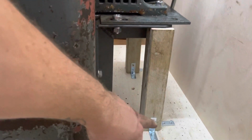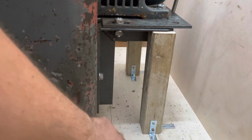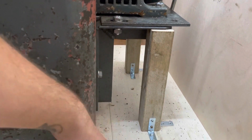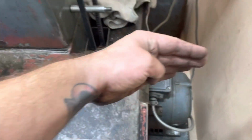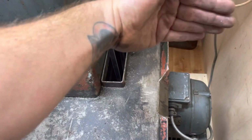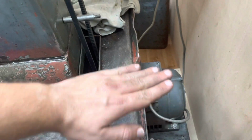They are obviously solid, and this angle here is slotted, so if I need to adjust the height of the motor, I'll need to shim underneath, but that's not the worst thing in the world. Remounting the motor, I've managed to get it parallel to the spindle axis, whereas before it was at an angle, and I've also got it nice and flat.